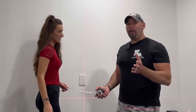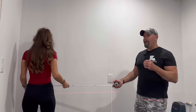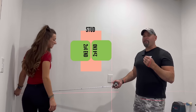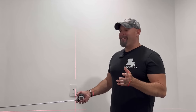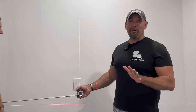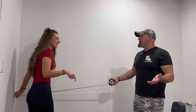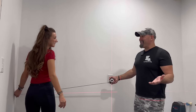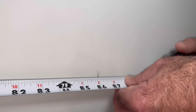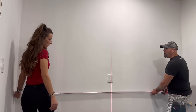One thing we're going to have to work around is we have eight-foot lumber and this is a ten-foot wall. We're going to go ahead and measure this and see where it lays out — we're going to have to use the buddy system on one of these studs. One of these boards is going to have to stop right even with the stud and the other one's going to have to pick up, so we can screw both ends into the same stud. Because like Lydia said, I know her and at some point she is going to sit on top of this thing, and I do not want it to crash and fall and hit this tile. The measurement we're going to do is 86 inches, and we'll pull the board away from that corner because the sheetrock mud is built up a little there.